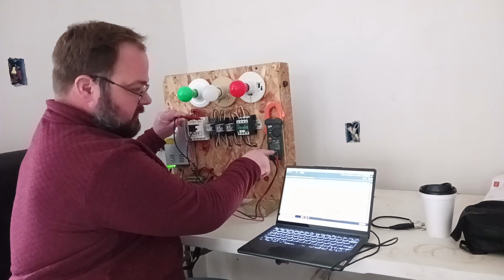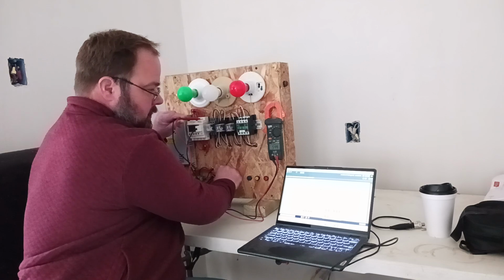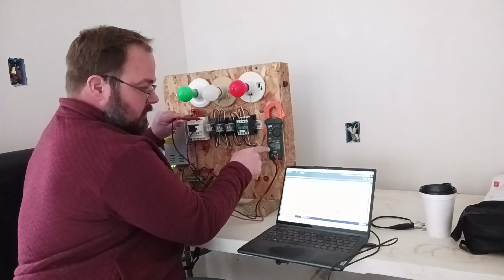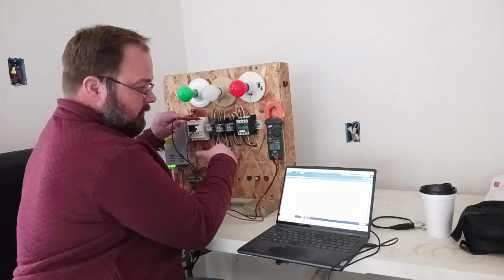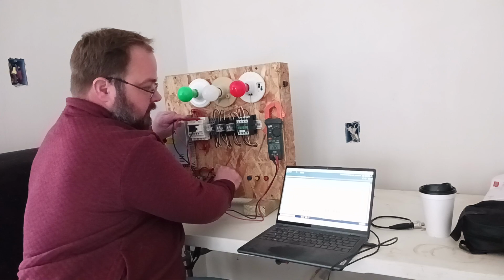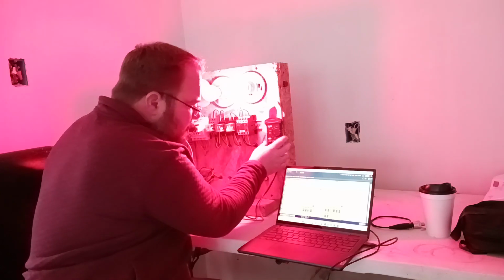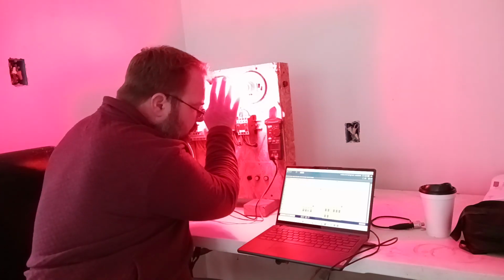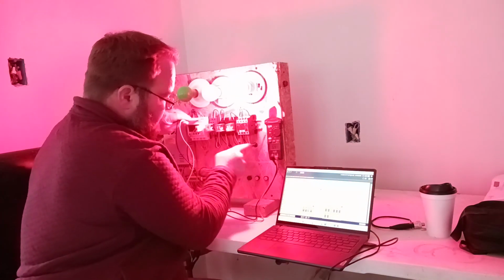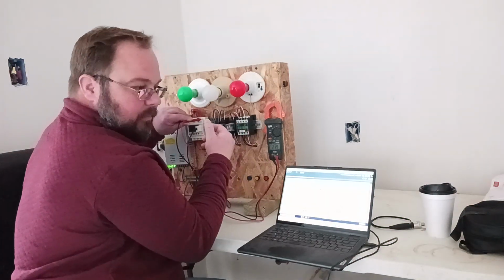Now you will see this is basically 0 volts, 0.04. As I move this potentiometer, you're going to notice the voltage is now, if I keep my leads on it correctly, 2.65. There's no output because I haven't reached 5, but you can see kind of how an analog signal works. It can be different voltages. Once I reach 5, there you go. There's my output because I am at, oh, my meter just turned off, but I believe I saw 6.41. Let's see if I can get it again. Yeah, 6.41. So my output's on because I have 6.41. I will turn my voltage down, and right now I'm at 2.19, so my output's off.